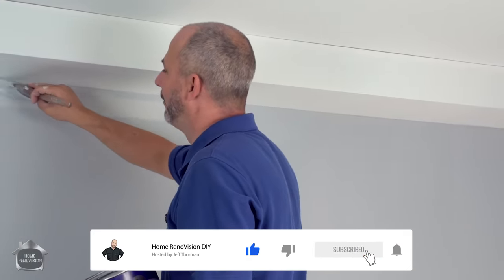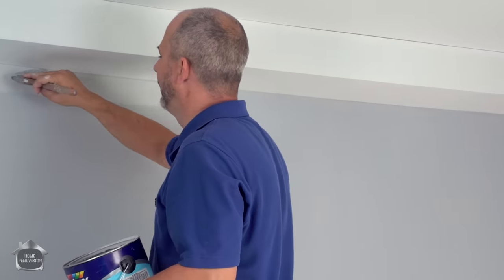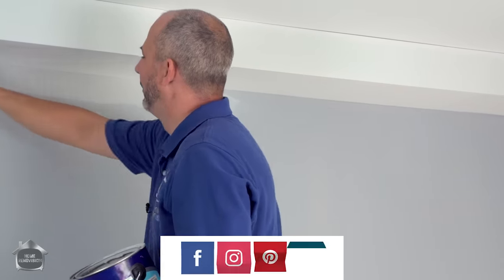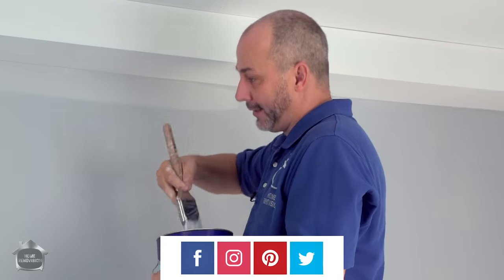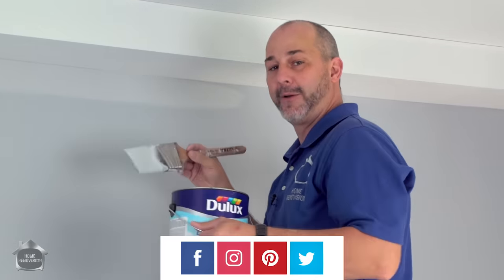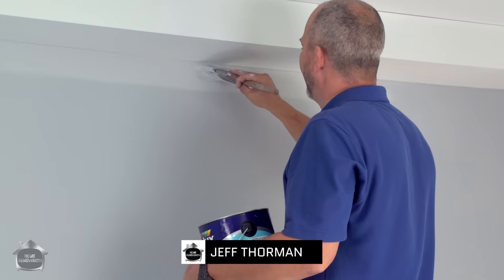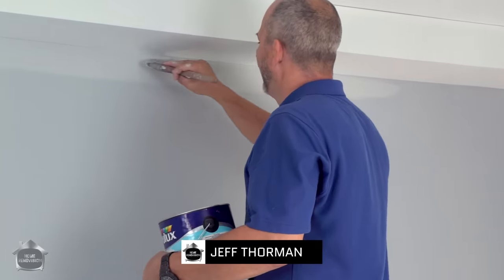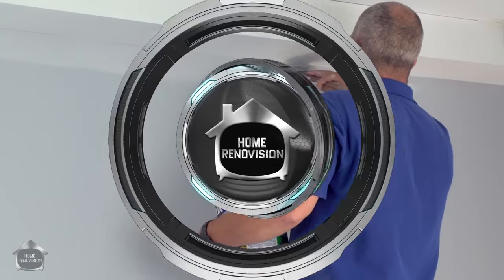Now listen, important to know that when you're painting your walls, on the first coat, you can do the cut after the roll. There's no rule about that. But on the second coat, you really want to do all the cutting in details on each individual section of wall and then roll it right away while it's wet. Remember, the technology in paint nowadays has it so that this coat of paint can actually dry in about 20 minutes. And you really want to go wet edge on wet edge. So having a good technique here to finish quickly is important.